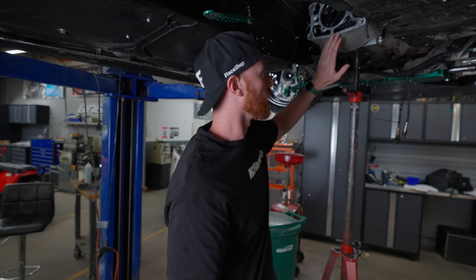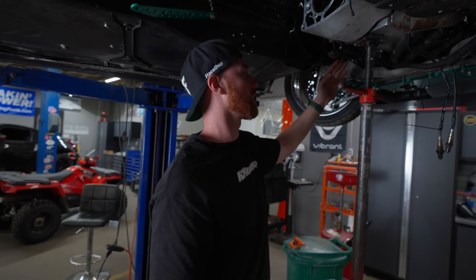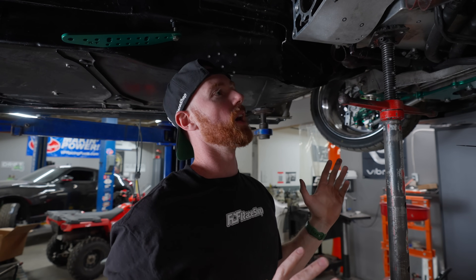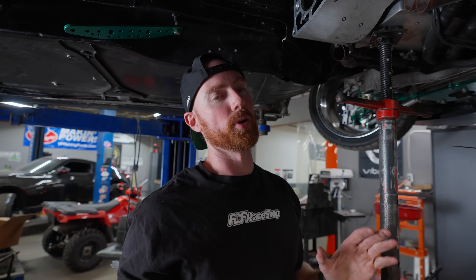In order to do a clutch, we had to take the slip joints off that are halfway up the exhaust, because this is a tri-Y exhaust — it goes from four to two, and then from two to one. It just was not working; the slip joints were leaking and all sorts of little problems.